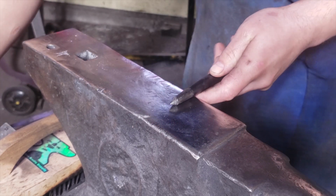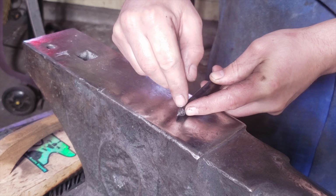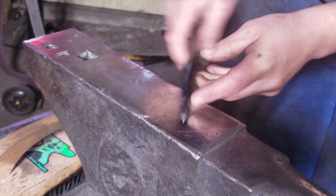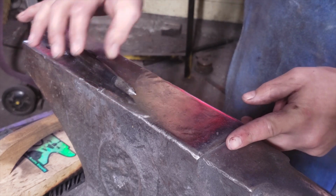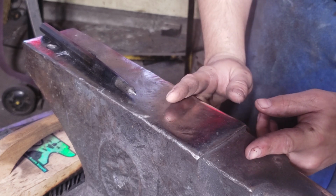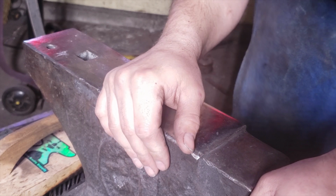Okay, first set down will be a nice short taper. Secondly, you start forging it on the shoulder to draw it out. Next shoulder, draw it out. So on that 2 inches, I'll try and turn that into about 4 to 5 inches long. I'm still debating on whether I want it nice and rounded or just keep it square. We'll see.